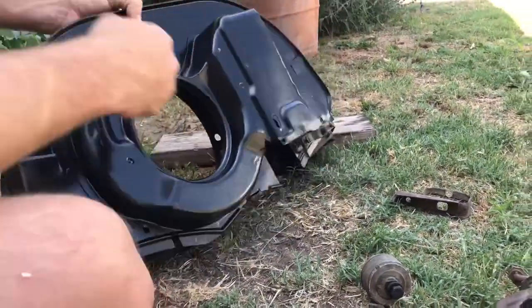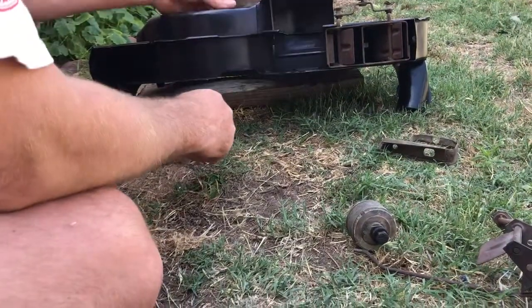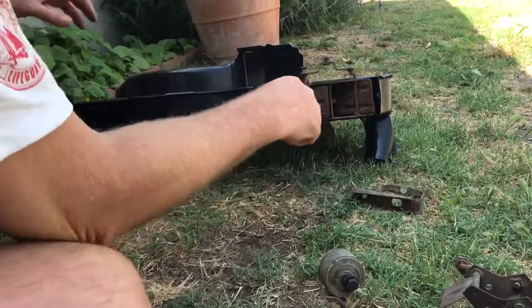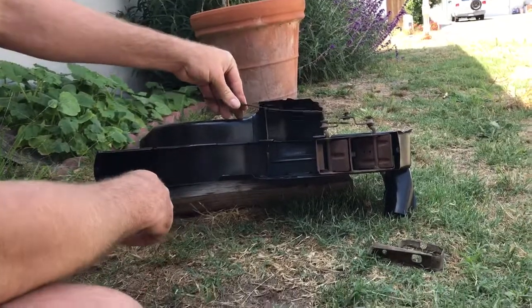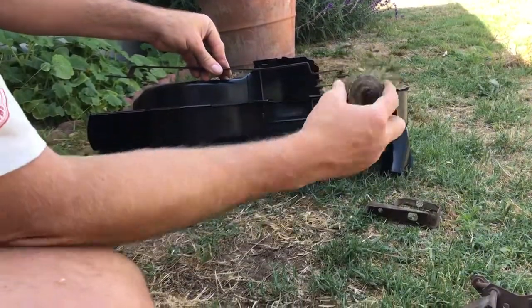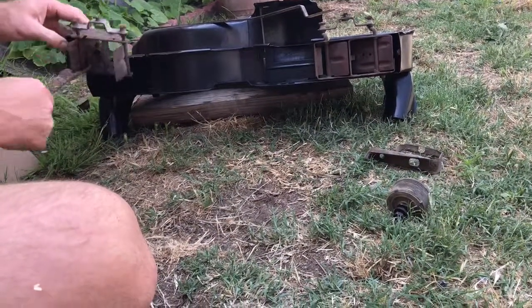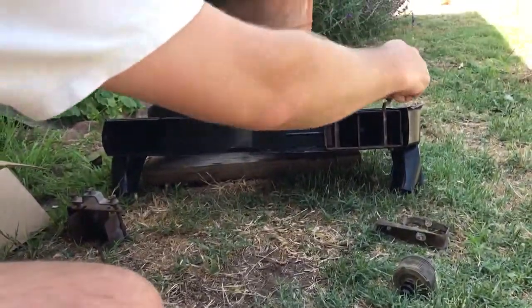This is a doghouse-style cooler. On a later model, this is where the air cooler goes in here. You'll notice these vents were found on earlier and later ones, and this bracket has to clear the doghouse when it's connecting one side to the other. As the thermostat pushes up on this side, it pushes this flap on this side up, opens these, and it pushes this bar this way and opens this one too.